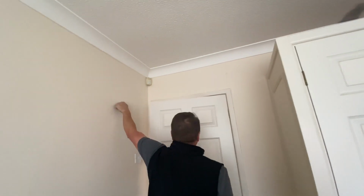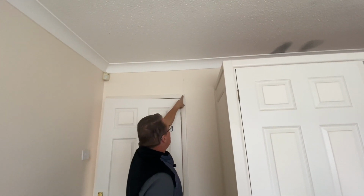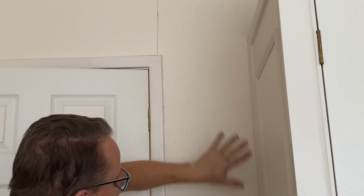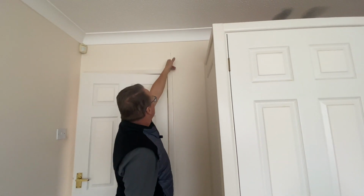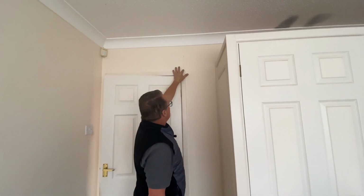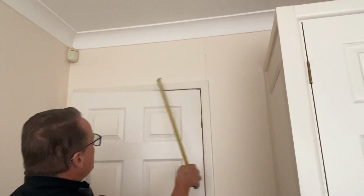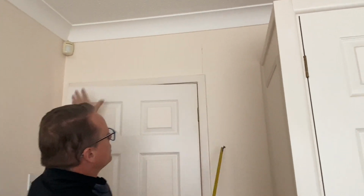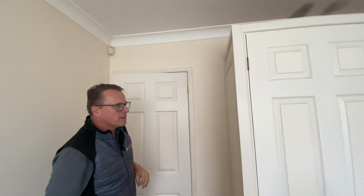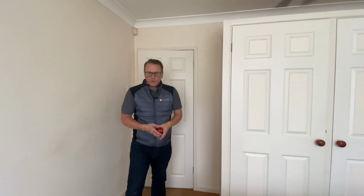That is really just a joint in the plasterboard. Outside, solid masonry. Inside, stud work. There's going to be a timber liner that goes up there. So whoever's fitted this put a sheet of plasterboard there. There'll be a joint in that bit of plasterboard and they filled it over. The way around that, if you're ever tackling a new house or doing some repairs, is to cut your first sheet of plasterboard to go round. So you've got a big L-shaped sheet, then you won't get any cracking there, because that is kind of a weak point.